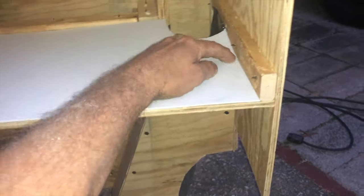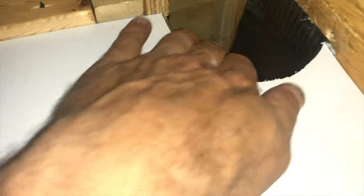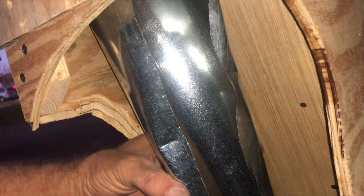Plastic base here, this is all gonna get caulked in. Waterproof the edges. Condensation won't run over any of these edges because it's gonna be dammed up and sealed, including the front edge here once the face goes on. All the condensation will go over this slope right here and down the slide. We have a nifty little metal slide that's gonna shoot everything straight out the in vent.